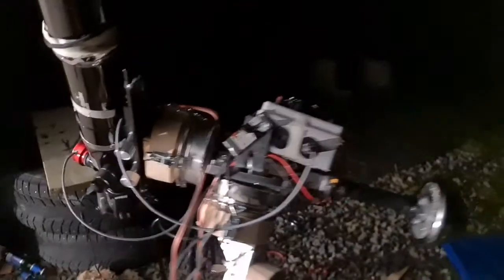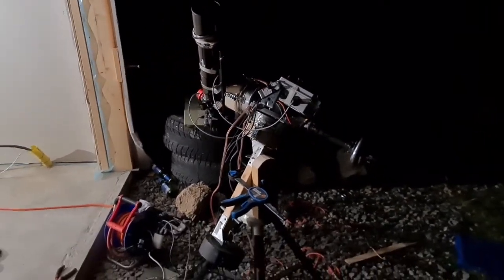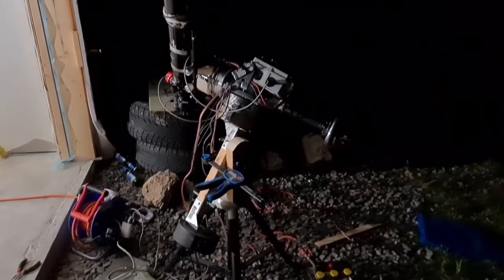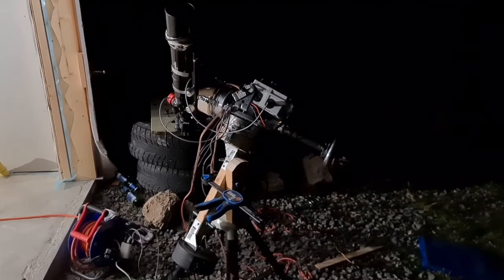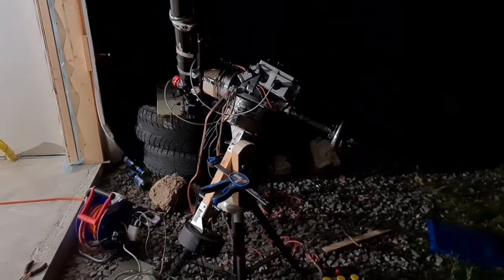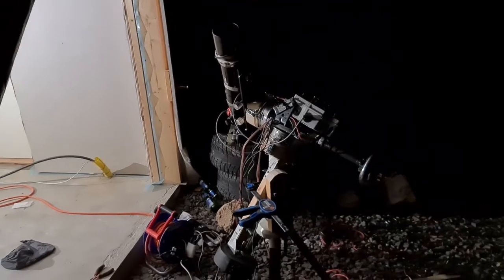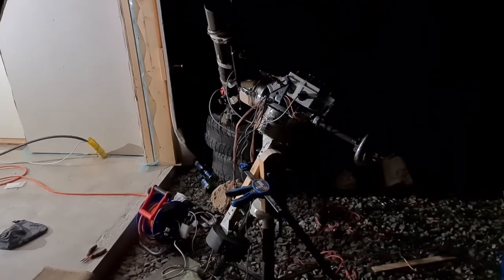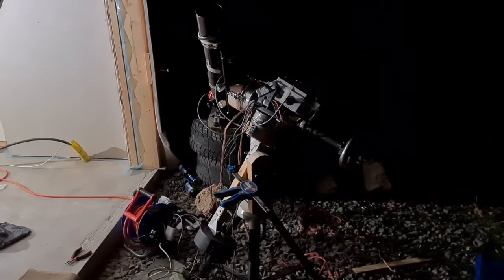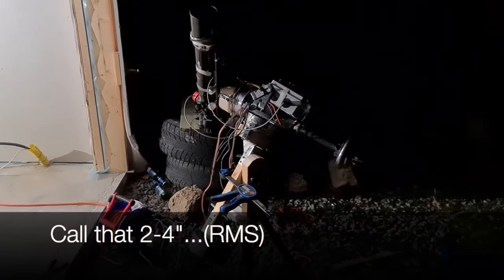Anyway, so it worked surprisingly well for being a first test. Not perfect, and since it's an open loop system, it's super sensitive to any external force, such as cable snags, balancing, anything like that is just upsetting it a lot. So if we take extra care for that, you can actually get a little bit of guiding out of it. Maybe about 1 to 2 arc-second resolution.